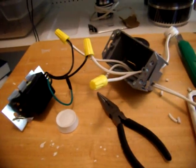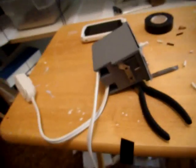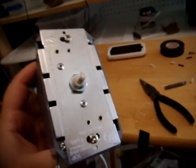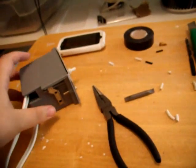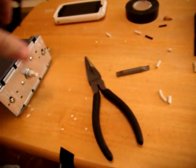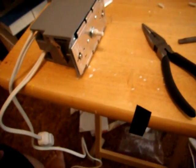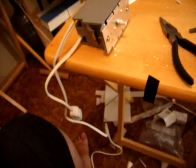At this point, it's done — everything is wired up the way it needs to be. All you have to do is pull the cables back through, put it back into the gang box, and use the little screws to screw it into the plate. Now that I have the wires pulled back through, there's quite a tail there, which is good, and I have it mounted into the gang box. All you have to do now is attach the face plate — it's pretty self-explanatory. You put it on, there's a screw here and here, then put the little tab on and it's in its off position.